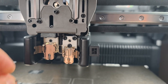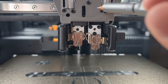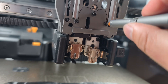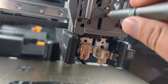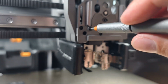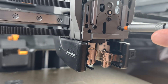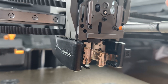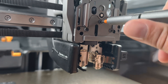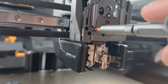Then you think about putting a post-it note on the front of the machine that says 'don't be an idiot, don't do it' — because it is a pain. Bambu have done a relatively good job keeping this simple, but if you don't know exactly what to do it's a nightmare. The first couple of times I did it I didn't know what to do and couldn't work out why it wouldn't come off — you're fighting the filament cutter and the jammed filament at the same time.